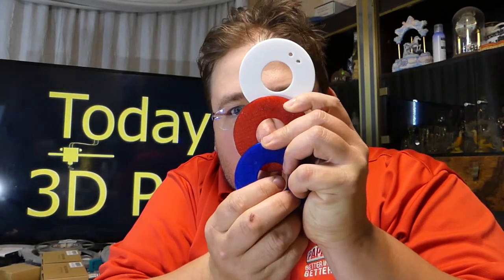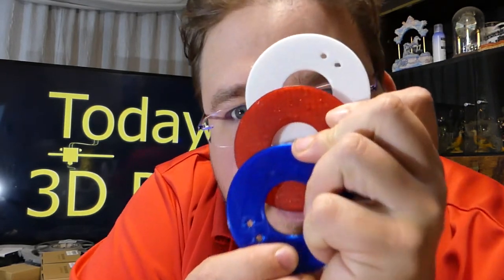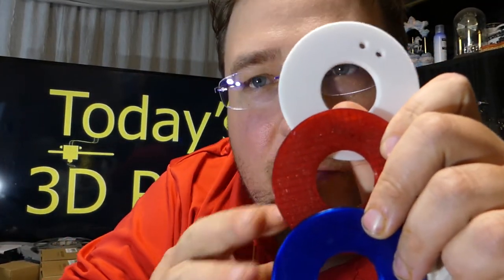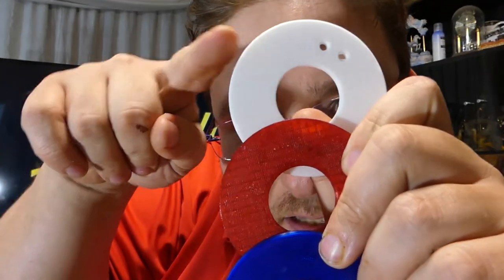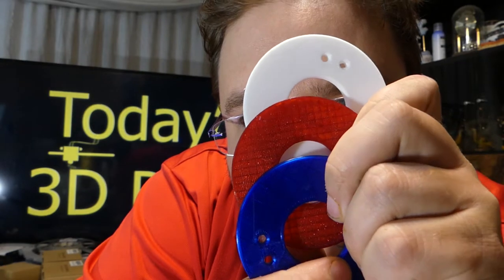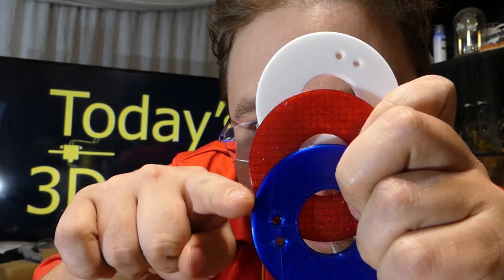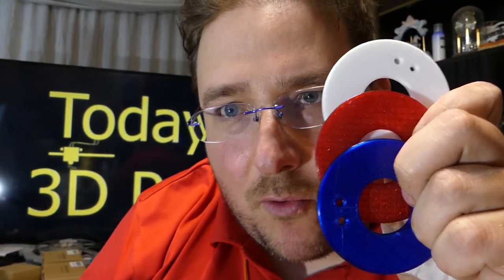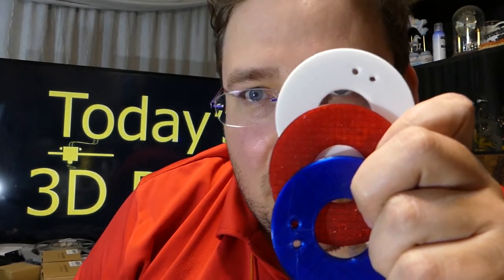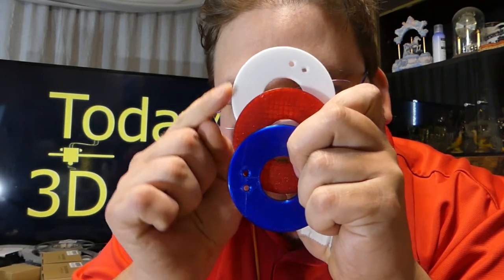Now, the lower your layer height, the more the overlap. And so the difference, if you look here, see how there's a pretty significant arc here? Think of this as 0.2 millimeters exaggerated, okay? So you have this as your sidewall. Now, if I bring the layers closer together, say 0.12 millimeter, you'll notice these are not nearly as large. See how the dips are tinier? That's why a 0.12 millimeter print looks so smooth on the side. It also reduces the little jitters in your printer that cause little tiny layer misalignments.